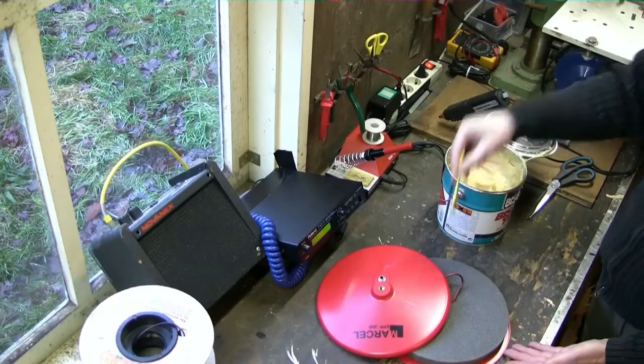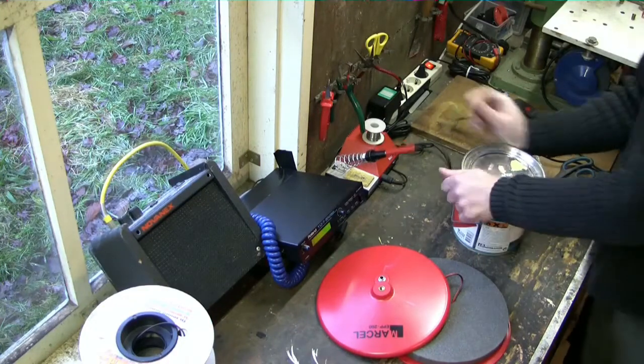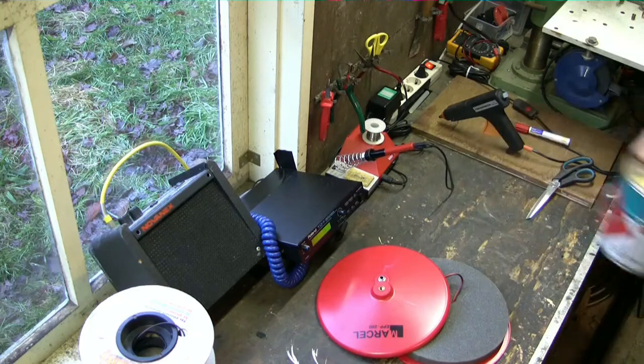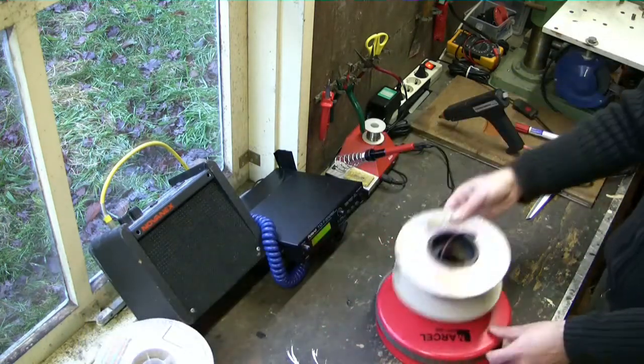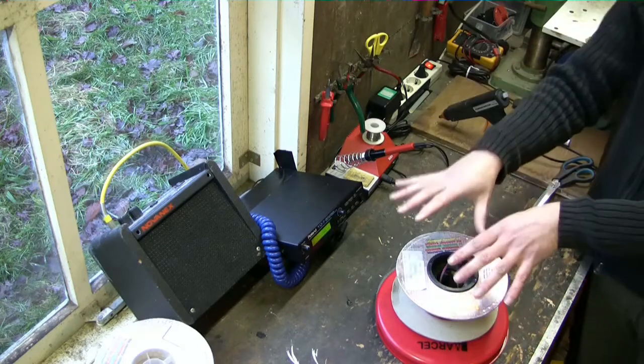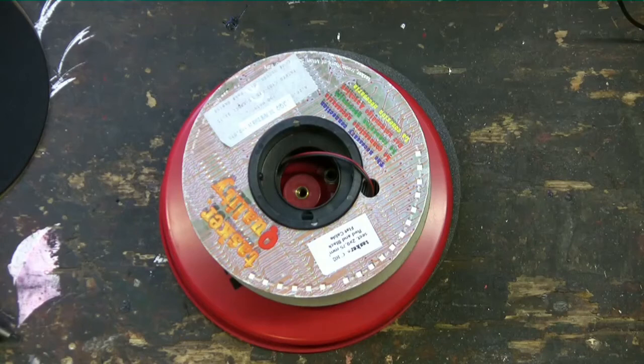However, do not let it dry 20 minutes, like it says on the label, because when used with foam, the glue dries a lot faster. Just put the glue all around, put the pad together and put some weight on it for about half an hour or so. Make sure the weight presses evenly.